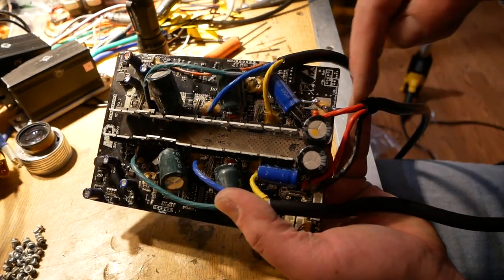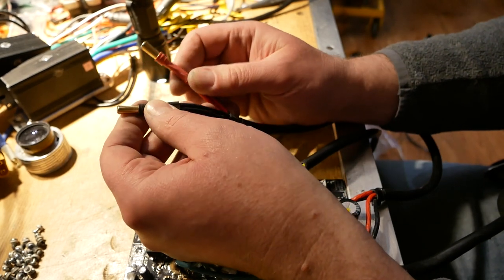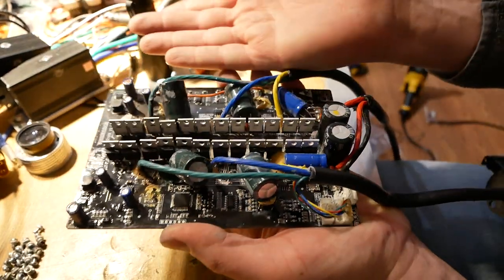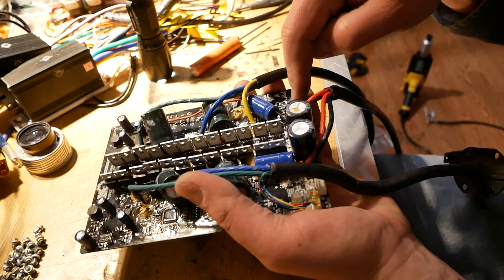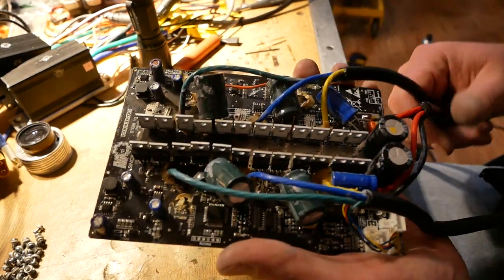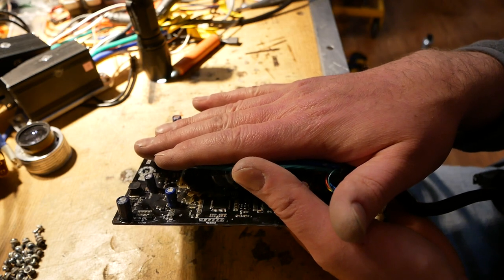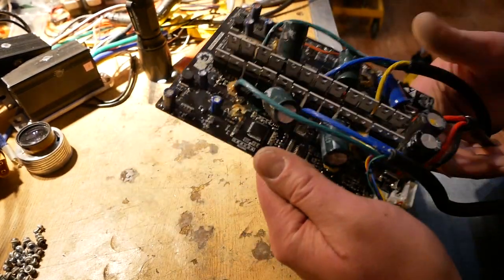There are battery plus and battery minus here and there, coming out the other side into a couple of six millimeter bullets — that part's good, I definitely like six millimeter bullets. From each side you basically have two mirror images of the exact same thing. There are almost no differences other than a hall connector and the fact that all input signals come in here and split to both. Otherwise they're electrically identical. In my opinion this is a Dualtron Storm controller with a couple of current handling upgrades to it — otherwise it is the exact same thing as what's in the Dualtron Storm, just getting pushed harder.